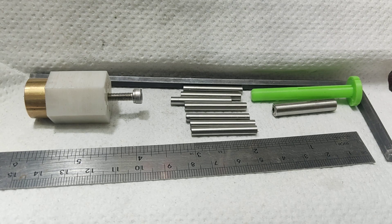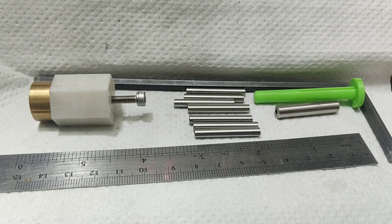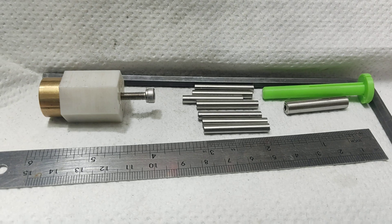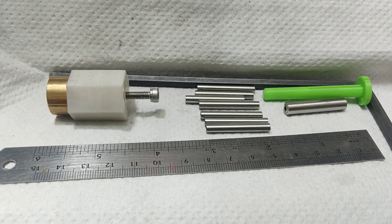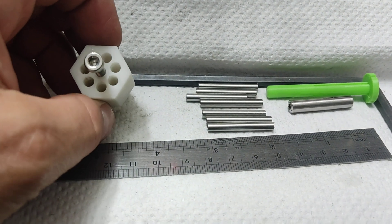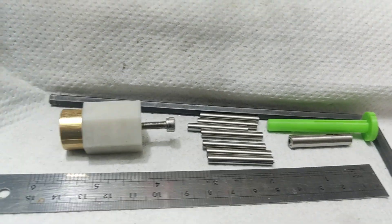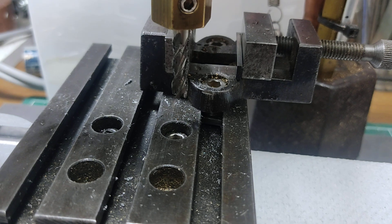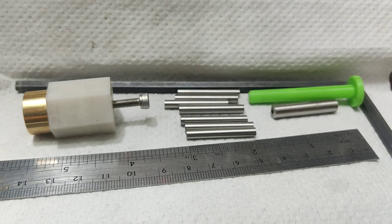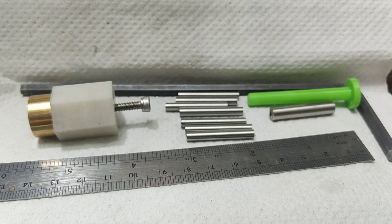So what do you think — can this be done, and if so, what am I doing wrong? I can say I probably should have made this mount from steel, not brass. The 3D printer is doing a pretty good job making the holes run concentrically, so I'm not worried about that. The vise is exactly 90 degrees to the X axis of the lathe-mill. So what do you think could be causing this? I'd love to hear your concepts.